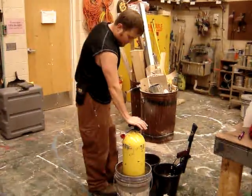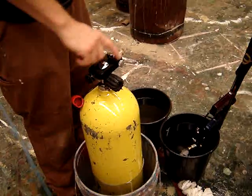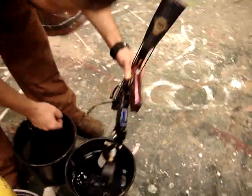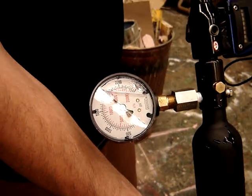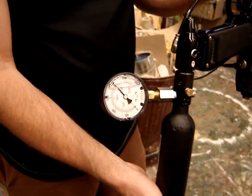Air supply right over here — a 3,000 psi scuba tank. We're using this little fill guy; it's got this little tiny gauge on here, which is probably precise enough but hard to read. So what we're doing is filling my 13 cubic inch tank with this nice big oil-filled gauge, which is easy to read and gives us really good accuracy. It's 1% accuracy, is that correct? 1% accuracy and with half a percent repeatability.